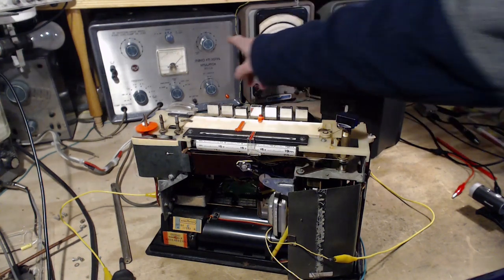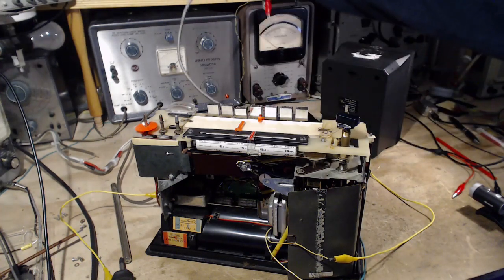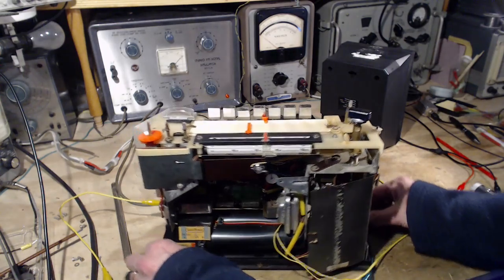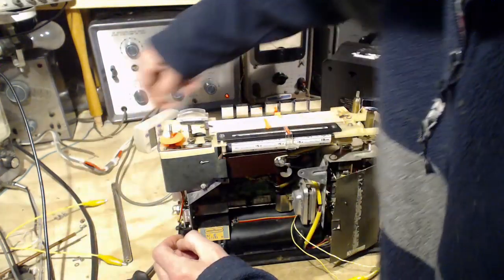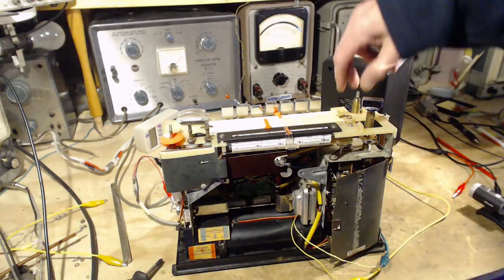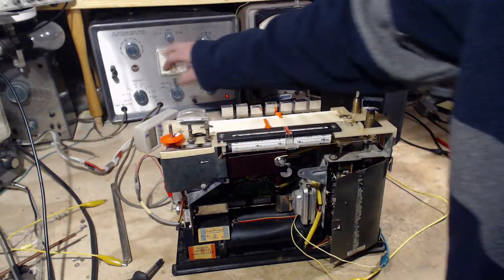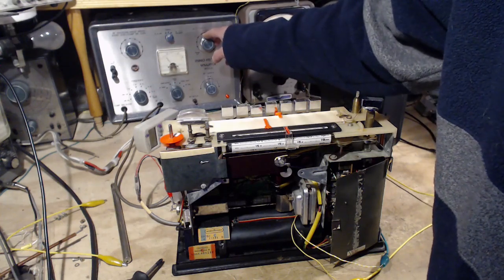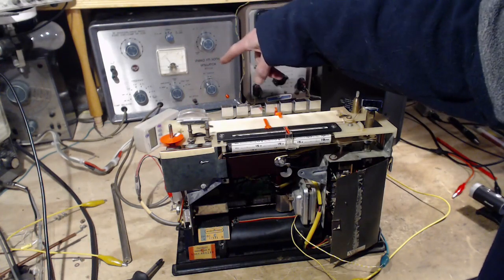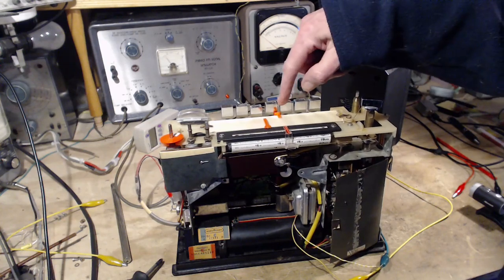Okay, here we go. Now I've got my stereo FM signal simulator going. The output from it is here. The antenna connection on the radio is over here. Just going to hook up the red lead, not the other lead. Okay, hear it. Right on the money. A little more volume. We'll turn this guy down. Carrier level. Here. So the carrier is now as low as it can be with that transmitter. This transmitter operates at around 100 megacycles, just a little bit back and forth. So you can see the pointer's kind of in the middle of the band.